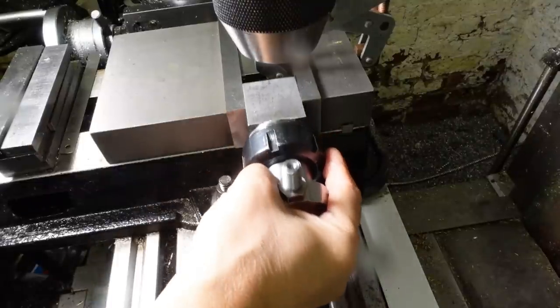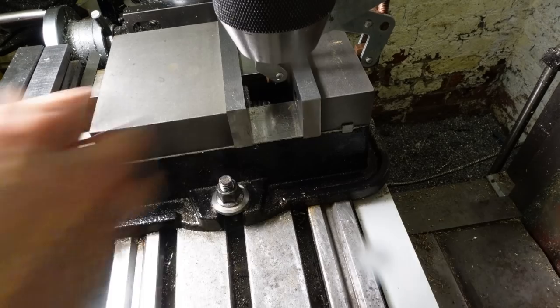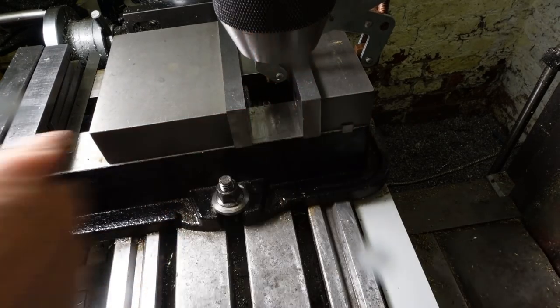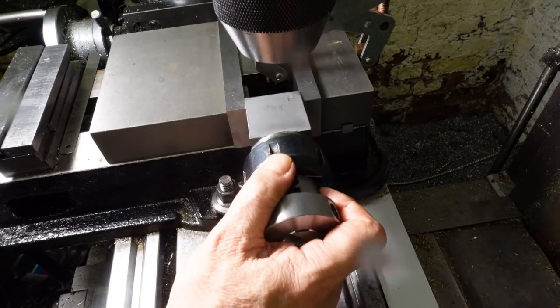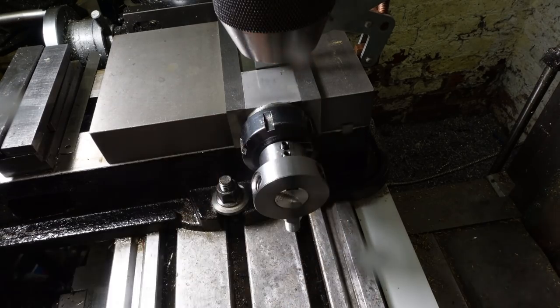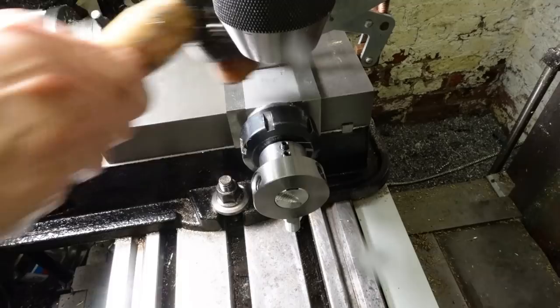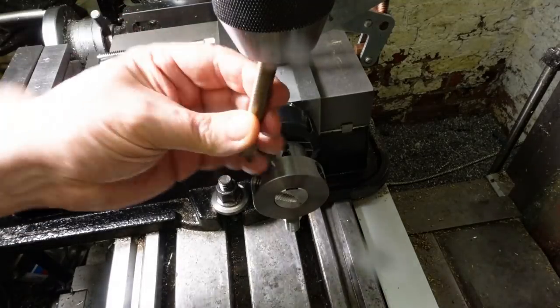As there are four new holes at 90 degree intervals in each collar, I'm using a square collet block instead of the hex one I used to make the 120 degree holes. The first hole is well clear of the existing holes at 60 degrees away, but the other two are only 30 degrees off, and the holes and threads will intersect the existing ones. Ominous foreshadowing.